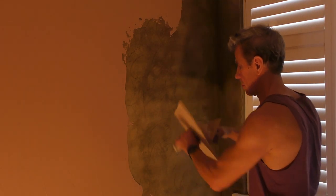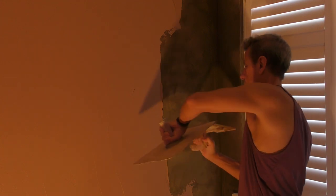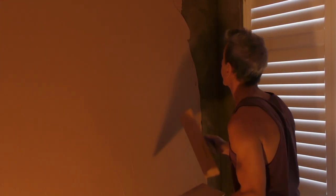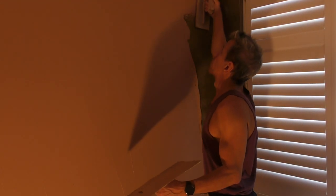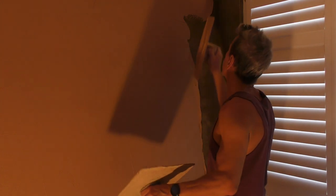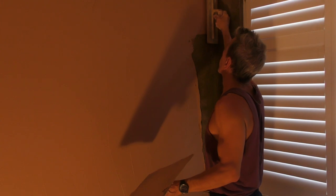Okay, first coat of finish going on. Again, with the PVA on the original plastered wall and the waterproof that's in the sand and cement, this basically - which is a good thing - means that the whole set does go off at the same time. You do have to be careful on sand cement like that with a lot of waterproof in it - when you put a skim on it, don't mess about with the skim because it will blister if you bring too much water to the surface too quickly, because there'll be no absorption whatsoever in the sand and cement.